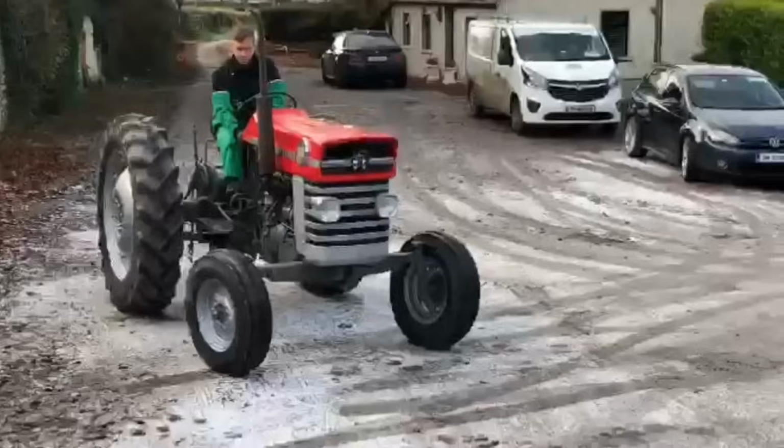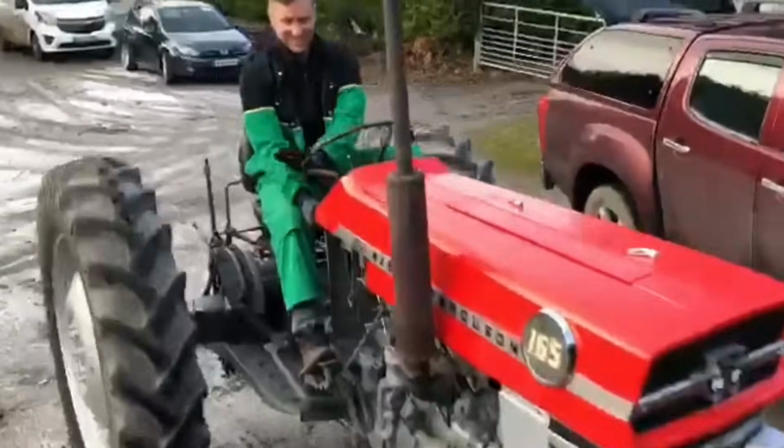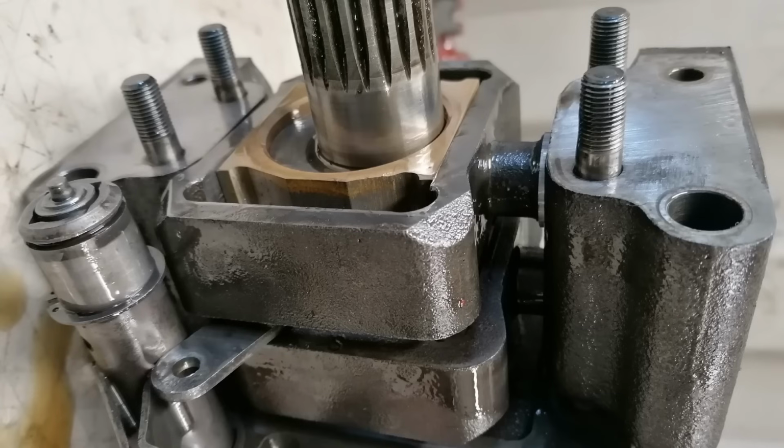The hydraulic system was of a stronger build than the 135 and had greater lift capacity at the ball end. Category 1 and 2 ball ends could be fitted, and the top link was of the screw adjustable type. The upgraded model, introduced in 1971, had a lift capacity at the end of the lower links of 1,588 kilograms. The four-cylinder linkage piston type pump delivered 14.1 litres per minute at an engine speed of 2,000 RPM, and the relief valve was generally set to 3,000 psi.